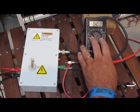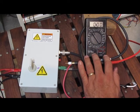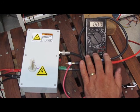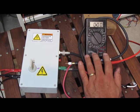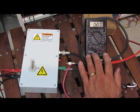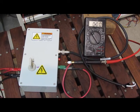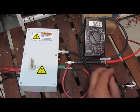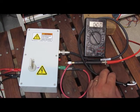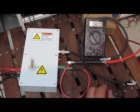These meters will be powered — the battery will be in place at the time I'm running the transients. As I'm going through these tests, if the meter stops functioning I would consider that a failure. I would also consider any arcing a failure. The real specification has the transient riding on top of the AC line voltage, so any kind of arc over inside of the meter could be a very bad thing. Any kind of arcing that occurs, I'm going to consider that a failure.